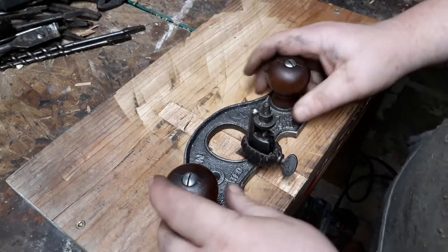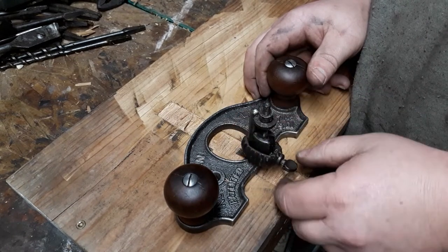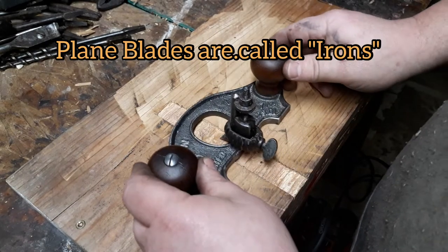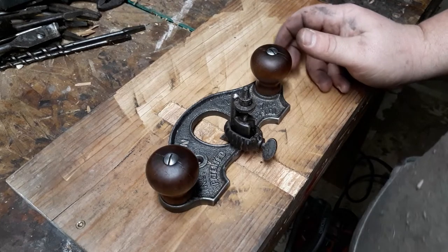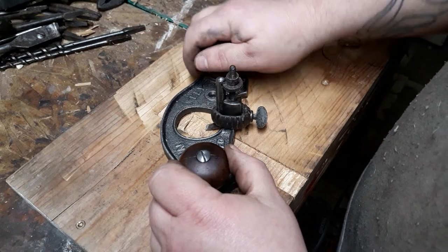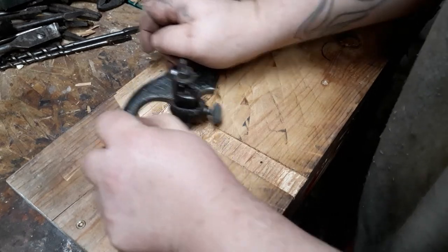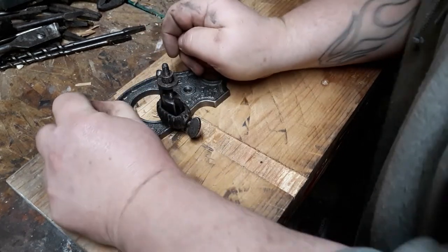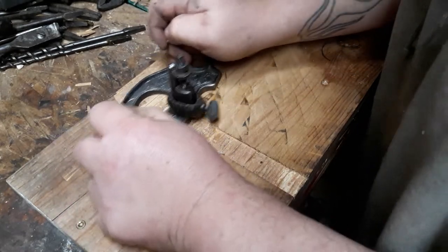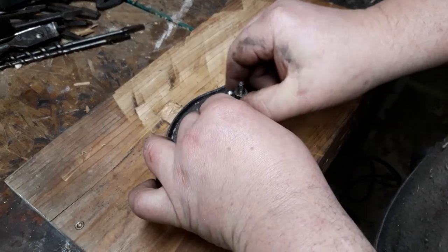So we'll pare this down, get it to the stop dado level we need. And we'll take this, loosen up here, and we'll drop that blade down to the depth we want. Let me see if I can scooch you around here. There we go. I'll skew it a little bit, and we'll get up in here. And once you get to that stop dado, you can run it across and cut it. You're taking very fine cuts with this. We'll go a little bit deeper yet right there.